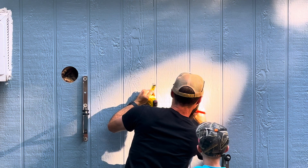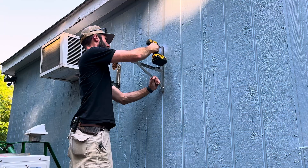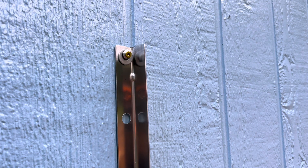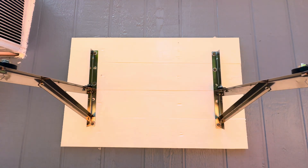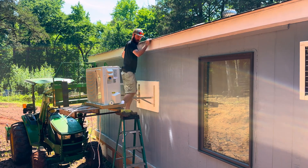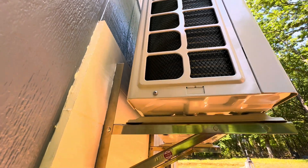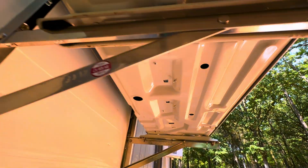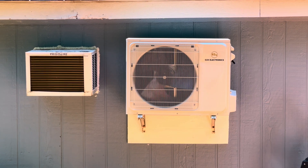The bracket is supposed to hold up to around 200 pounds. Unfortunately the right side did not hit a stud, so I couldn't get it to hold tight. I decided to put up some 1x4s, painted them, and they gave me a nice solid base to hang the brackets on. As a bonus they covered the hole I needed to patch anyway. I struggled to get this really heavy unit onto the brackets — definitely a two-person job — but once it was up there it was super secure and I'm really happy with the way it turned out.